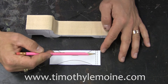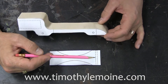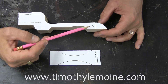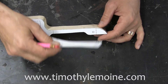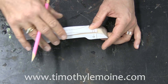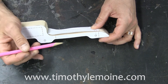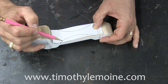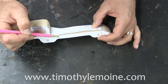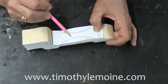As I look at it I notice that I have a landmark. This is a hidden line, and that hidden line is showing me where that axle hole is from the top. So what I like to do is take that and get that axle hole to line up approximately right above that area — that is where I'm gonna glue. I also have another landmark here where my arc is, and you'll notice it comes out and lines up with the line. Line up these key features on your drawing and then glue this thing down.